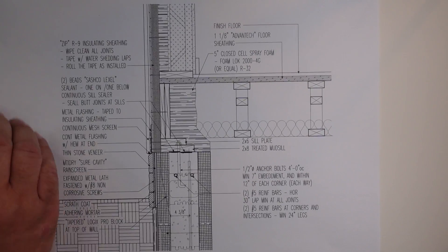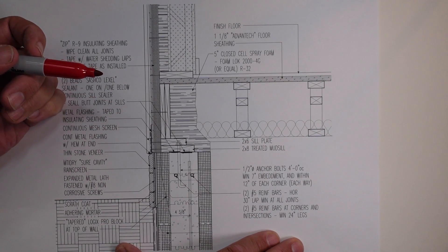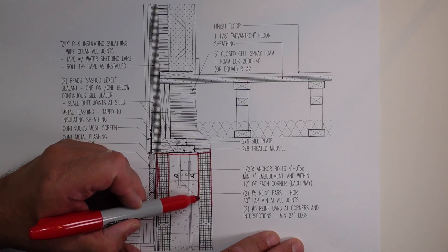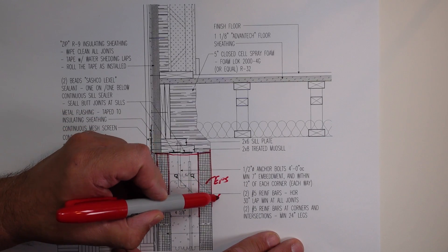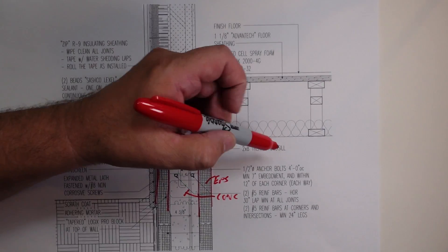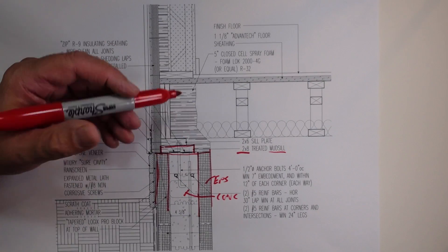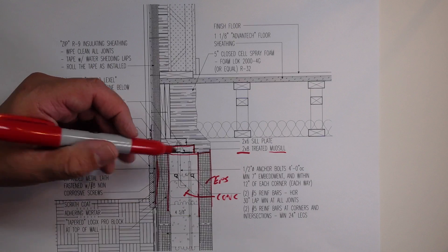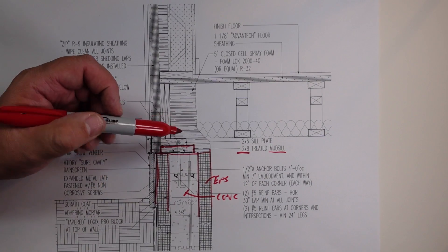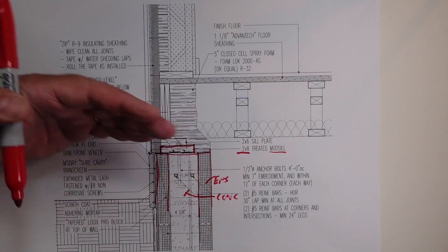So we're out there. We saw them putting that mud sill down. And you can see here, here is our ICF wall with the concrete core and the EPS foam on each side, and concrete in the middle. But you can see here, that is our mud sill. And here we went to a two-by-eight mud sill — just to get a little bit more of that treated mud sill over the concrete. With a two-by-six it would stop somewhere in the middle; the two-by-eight gets us over there a little bit more and gives us a little bit more of a flange to do our detail.